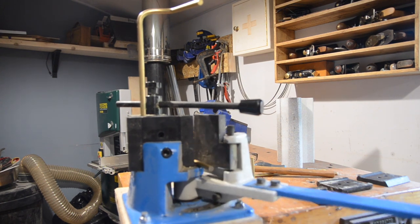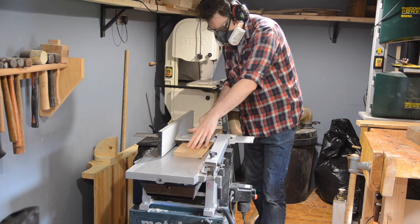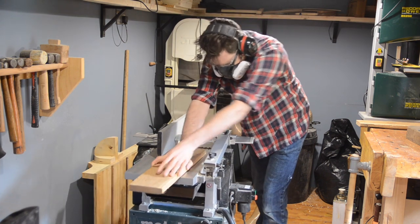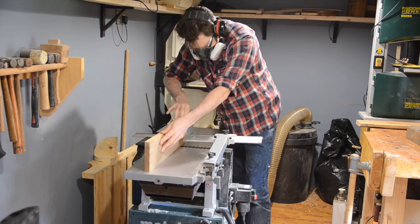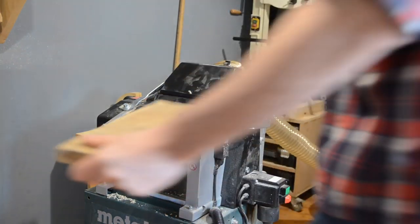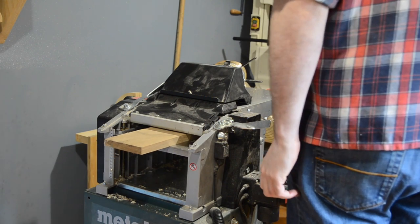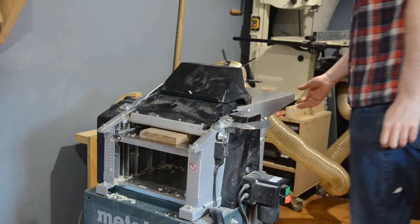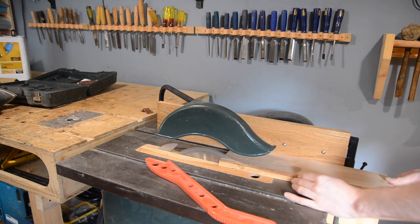This was a bit more tricky to do. With it all bent up I need something to mount it onto, so I find a little bit of oak. First I plane one surface then I can get an edge done. With those two done I can get it reconfigured as a thicknesser and pass it through. I get the final edge cleaned up on the table saw.